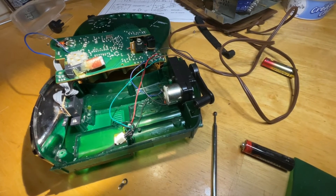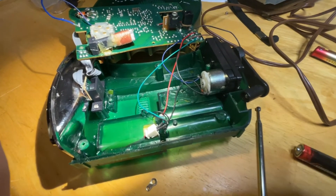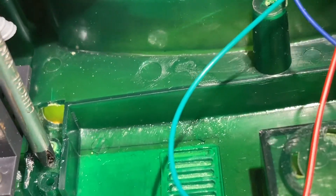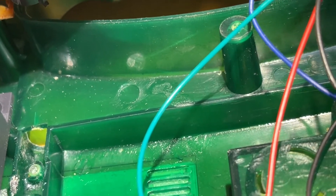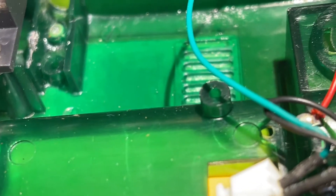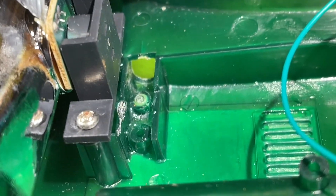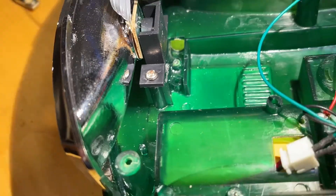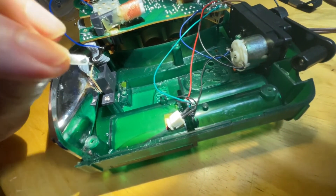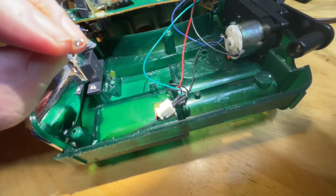Okay, I'm back. I wanted to show you the epoxy job before I put everything together, and I found another little discovery about why the antenna wire came out. Here's the epoxy — it's in there really well, hard as a rock, not going anywhere. That screw will hold the antenna, which will slip through that hole right there. Here's what I think happened with the antenna wire: there's really just a tiny blob of solder on the end. There's no solder on it — just a tiny little piece. No wonder it came out.